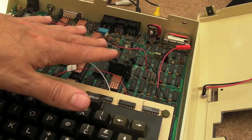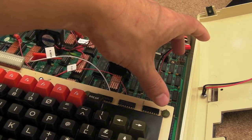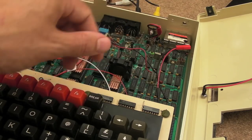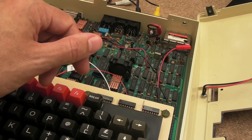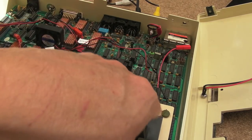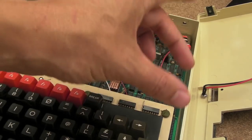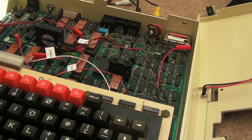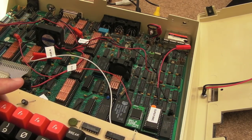There are some of the old school RAM ROM boards that sit over the CPU and expand out this way, and you have like 14 or 15 sockets there for EEPROMs. And it might not be that many, it might be like 12 or so, because you've still got a couple of the ones down here as well. But one of those, with lots of individual EEPROMs, that's going to consume quite a lot of current, I would think. So the fewer chips you go with, the better. I'm not following my own advice here.